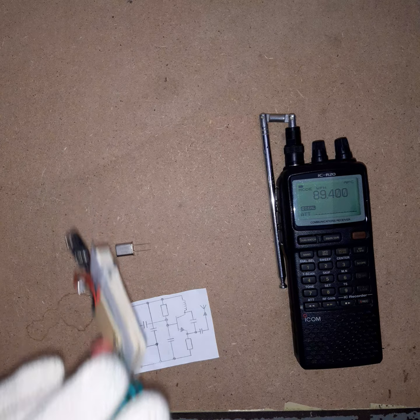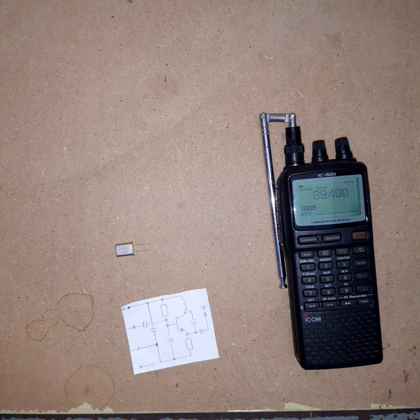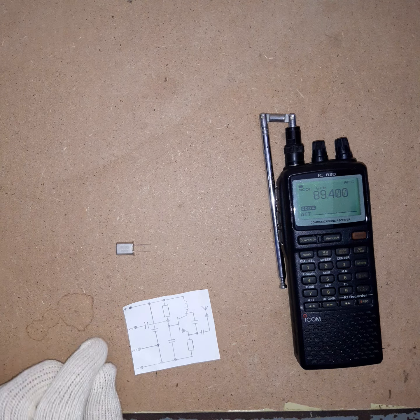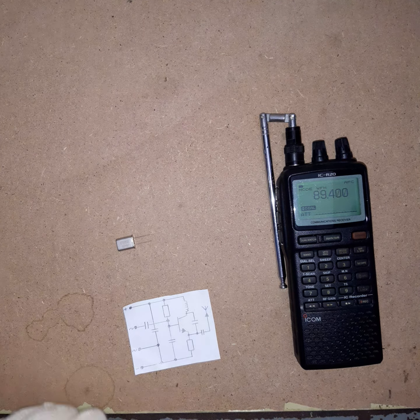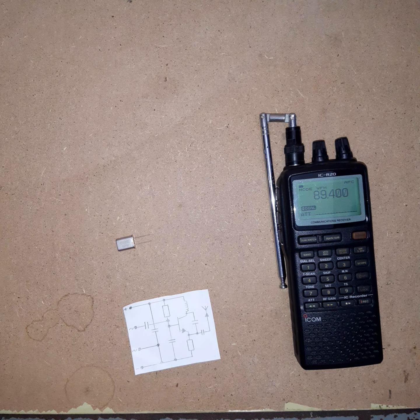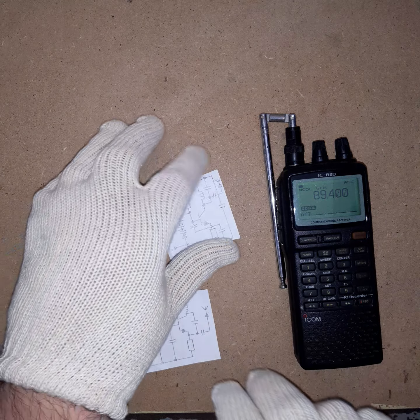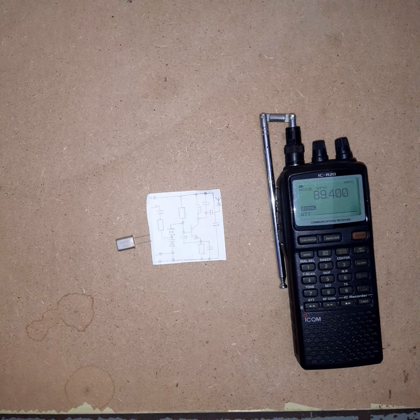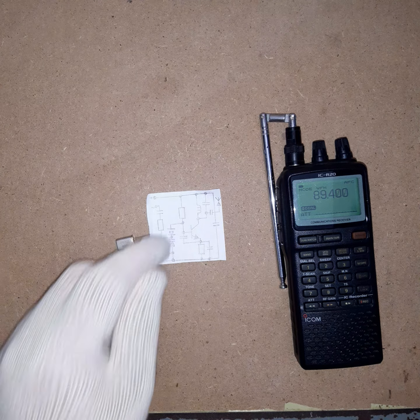but I can tell you it doesn't work that way. The crystal is cheating a bit, because although it says 100 megahertz, it's a so-called fifth overtone crystal. If you put it into a simple oscillator, it will oscillate at 20 megahertz. And there is a thing people do and did in the past, and you can make it that way, and this is how they did it. Here is the circuit for it, and this is a very simple, crystal-controlled FM transmitter. Here you can see the crystal.